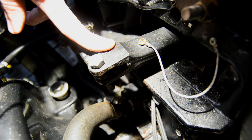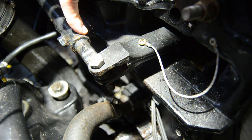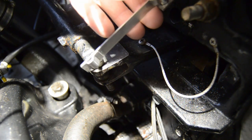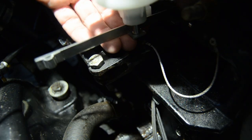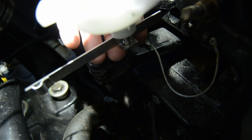Right, guys, here's the stern drive on port side, the steering column. Got the linkage here from the power steering system on the starboard engine. And here I went to connect my rudder angle sensor. It's gonna require building some brackets, putting this in place, and being able to follow that motion.